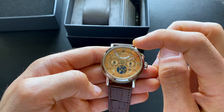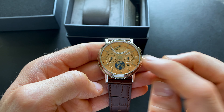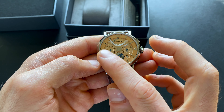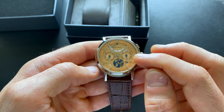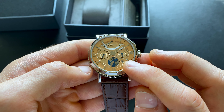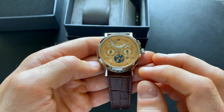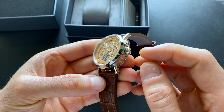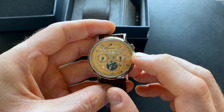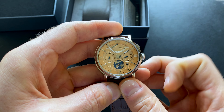For the basic layout of the Miyota 9100, you have your primary hour and minute hands but no running seconds hand. At 12 o'clock you have a power reserve indicator going up to 40 hours. Shifting over, you have a day complication, then on a sub-dial you have the month, a window for the date, and finally a 24-hour display. Consistent with the movement, there's a crown plus a pusher — the pusher controls the month, as you can see advancing as we click through.